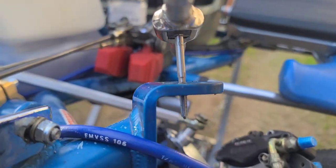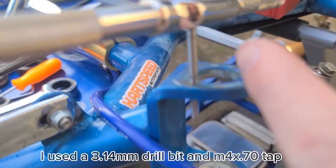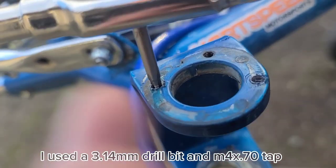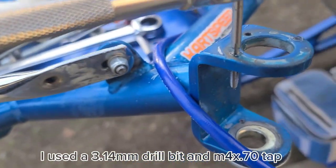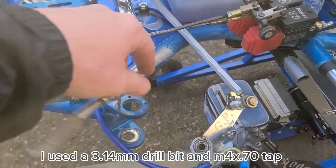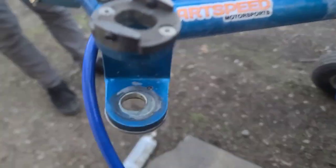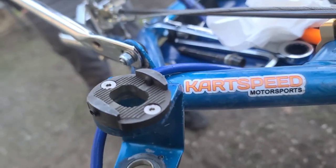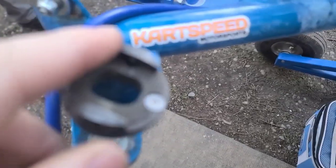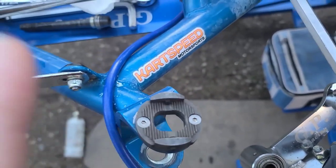I'm going to go ahead and finish drilling those. Both holes are drilled and tapped. It's not perfect — you can see it's got a little bit of lean to it, better than the back one. The back hole, I don't know what I was going off of, but it's not very straight. That's not going to matter though, and I'll show you why. Now I have the two allen screws installed and you can see, although I drilled the holes at a slight angle, it doesn't really matter — this key-ways into the frame and just sits a little crooked, but that's okay.